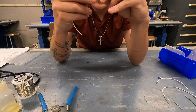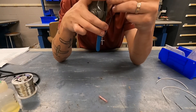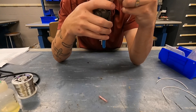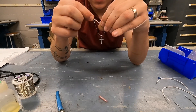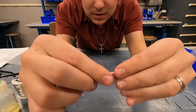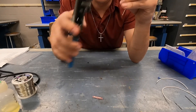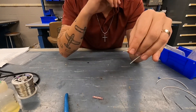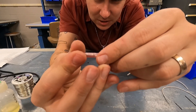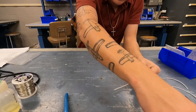I'll take it inside the butt splice and check — I only took off about an eighth of an inch, I meant to take off a quarter. If you strip too much, you can very easily take flush cuts or diagonal cutters and shorten it until it's perfect. Now if I stick this all the way in there, I can see it bottomed out inside, and the insulation is ending right where I want it to. The butt splice — really, really easy.